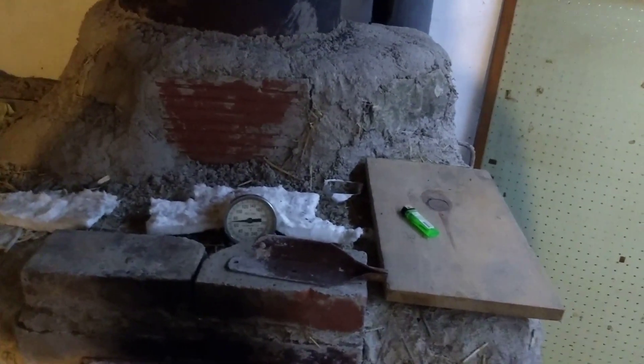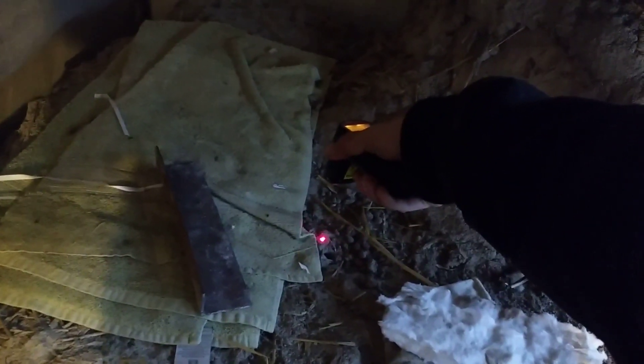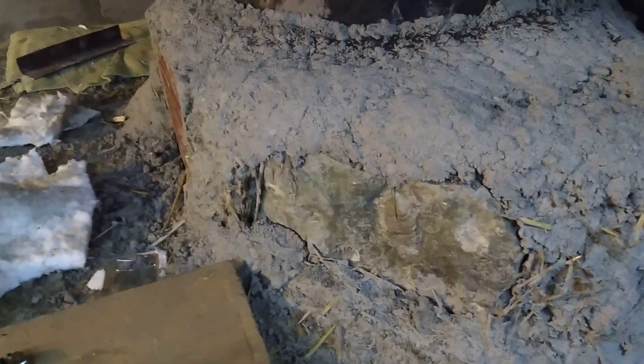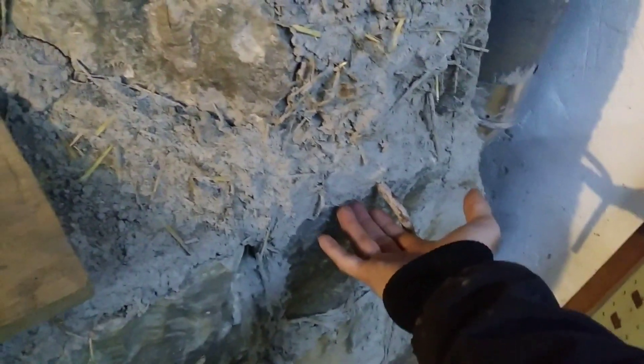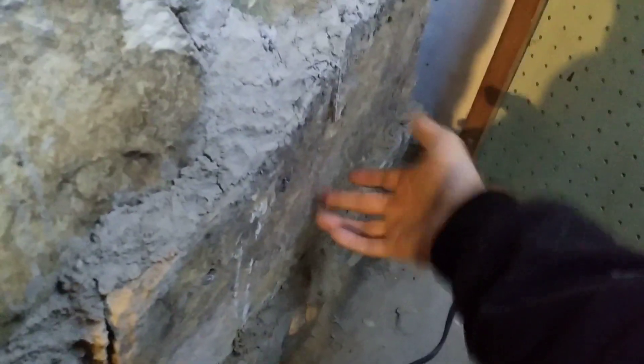The way my bypass is situated, the inlet of the bypass and the base of the chimney is just slightly below the roof line, so we will be getting some heat onto the roof. It's 125 degrees — stays pretty nice even with the bypass open. When I close the bypass, the exhaust level drops, and the inlet to the chimney is about this level — about 8 to 10 inches off the floor. Closing it forces all the heat down into this mass.